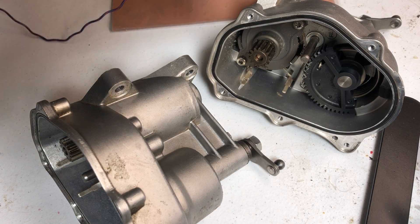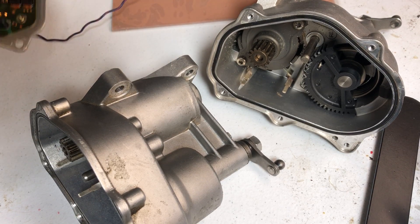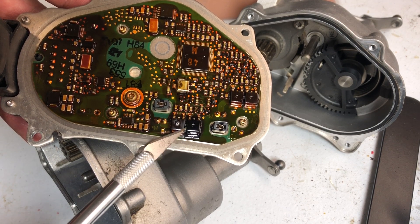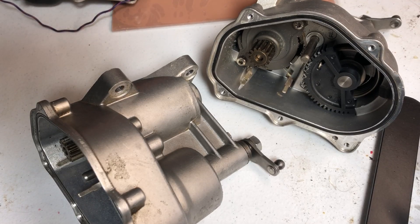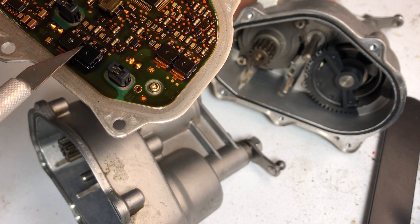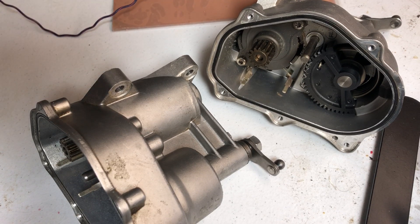This is the unit we just got from the non-working bank one. As you can see, the transistors are burned completely. Lots of people say just buy and replace them — you'll be surprised, you replace them and they're going to be burned again. This is a secondary problem, it's not the root problem.